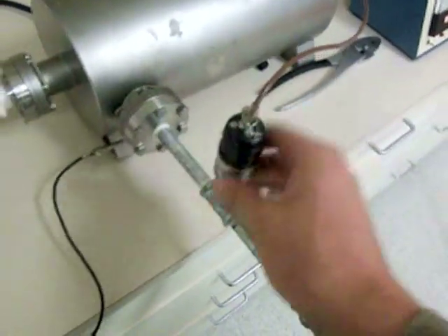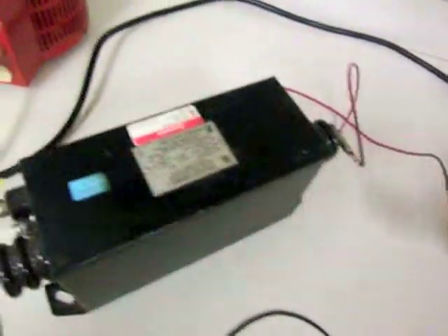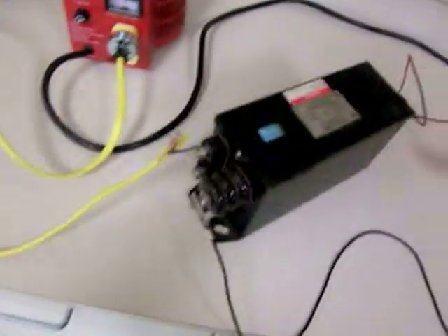This is the vacuum reader. When I get it down to 30 or 20 microns, I'm going to probably keep the pump on or shut the valve off, depending on how bad my leak rate is. Then I'm going to turn on my neon sign transformer and we're going to be in business. And that's a quick overview.